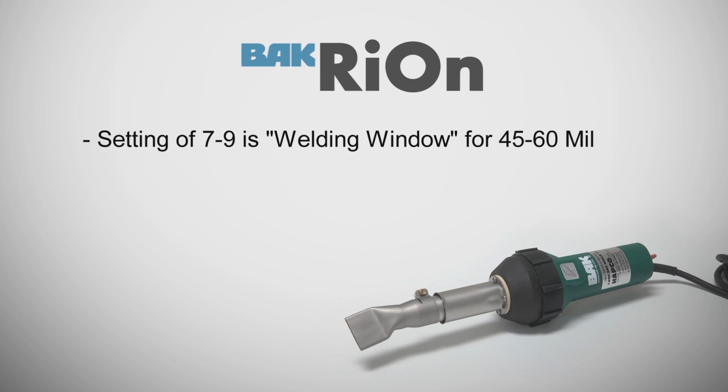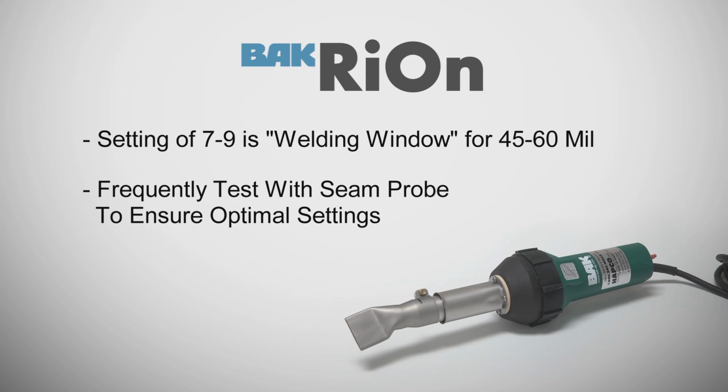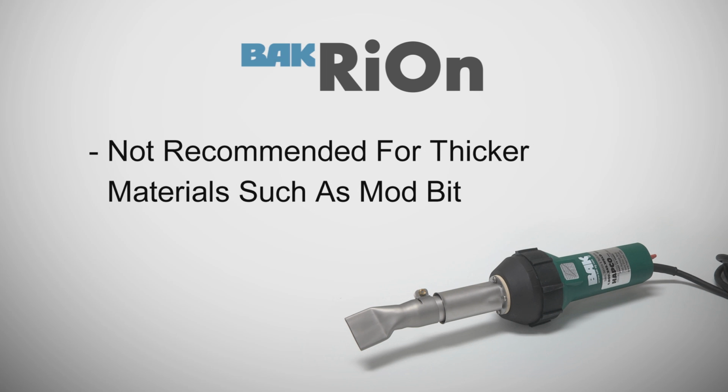While a heat setting of 7 to 9 is a common welding window for most membranes 45 to 60 mil in thickness, it's important to frequently test with a seam probe to ensure a proper weld temperature is being maintained. Because the RiOn is specifically calibrated for single-ply TPO and PVC membranes, it is not recommended for use on thicker material such as modified bitumen.